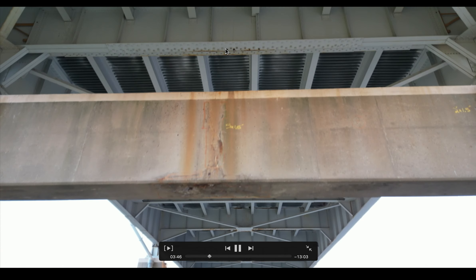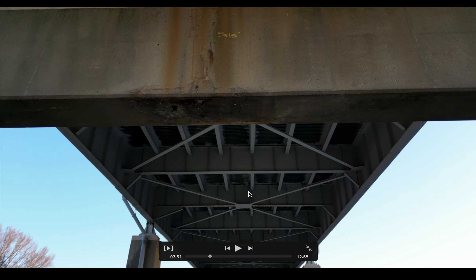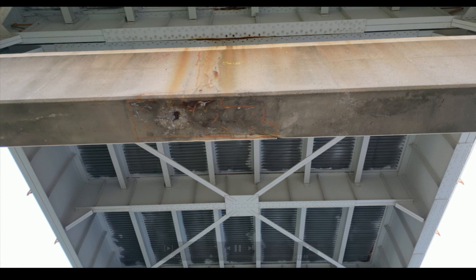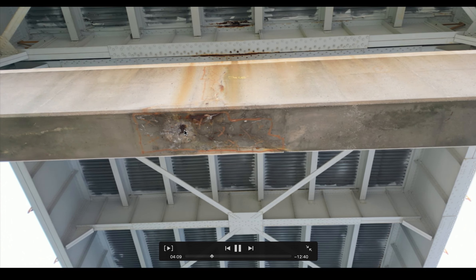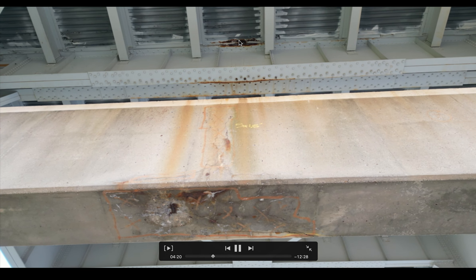Why is the water pooling at each one of these? Clearly this bridge has some deflection, and this steel is directing it that way — or the covering layer of concrete and asphalt over the years pitched it toward the middle by repeated mistake. There's the rusted deck. Looking up at the underside: rust of steel, you can see the layer of the stirrups — the depth of them. That's your stirrups of this beam. Straight above is the swelling of the steel from the water. And there's the gutter, I'll call it.